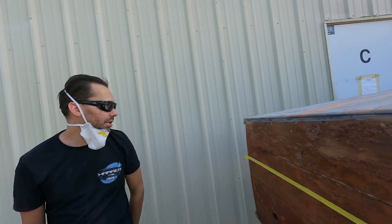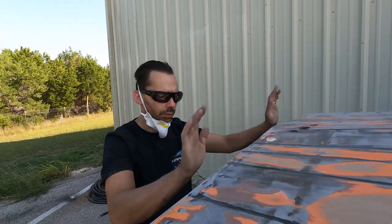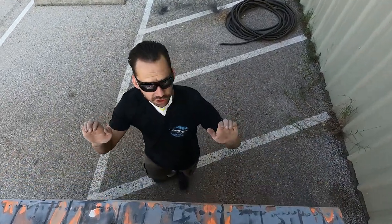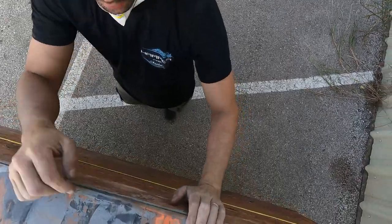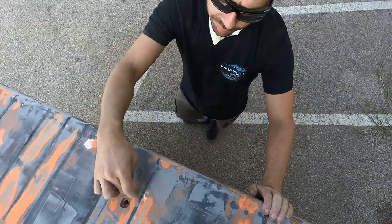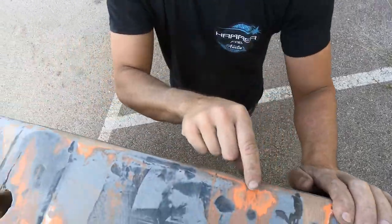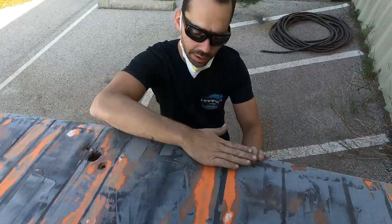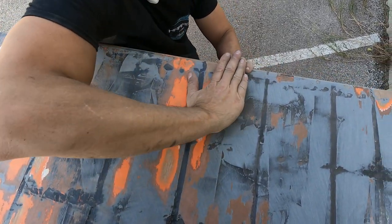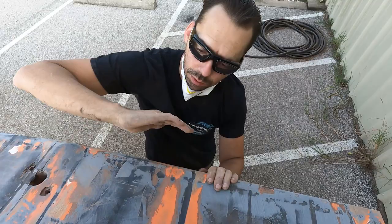Both sides look pretty smooth. Now the next step, before we put the pieces of aluminum on, we're going to put this back panel on first. This back panel has to go on first because it's going to be like an L-channel, and we're going to recess it down the 90-thousandths thickness of the metal so that the metal becomes flush. We'll glue and seal it on the back and seal this whole corner off real nice. Then we'll pattern and cut the side sheets to overhang this one, so absolutely no way water could ever get in there when it's all bonded with epoxy.